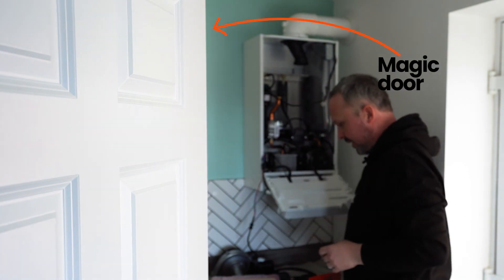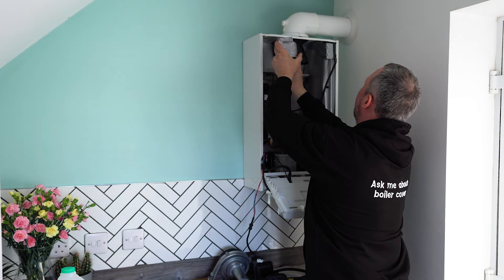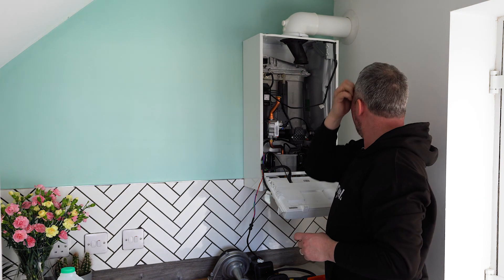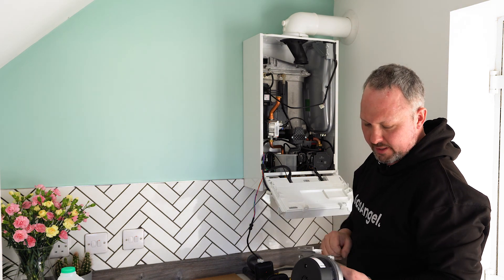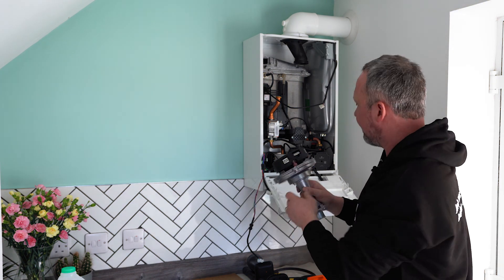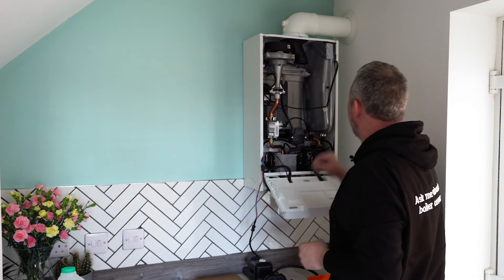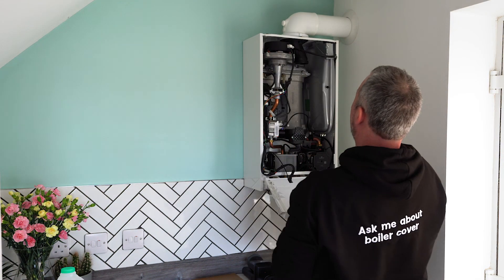The trap's back in and now we need to replace everything in reverse. So first thing is put this back on and lock it through in reverse. That's the burner back in. Now we're going to put the fan back in. First thing is to visually check the fan — again, there's a seal on here, that's intact, that's fine. It visually looks absolutely fine, no problems. So we'll put that back in. You'll see that this washer here fits in there — that's just a seal to the main burner. That's the fan back in, so we'll now connect it all back up electrically.